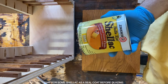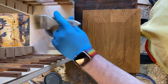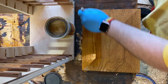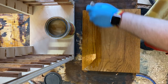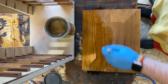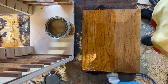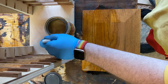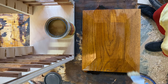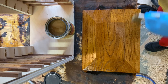That's what it looks like once the dye is dry. Now the next step is to shellac it — I'm putting a seal coat of shellac on, just as you get it from the store, not diluted. After this I'm going to apply a glaze using oil-based gel stain. The shellac keeps the wood from absorbing all of that stain and just lets it get into the pores to make the grain of the wood a little bit more obvious. It ended up looking really, really beautiful.